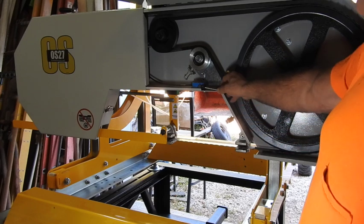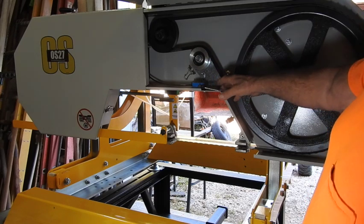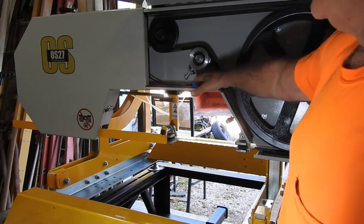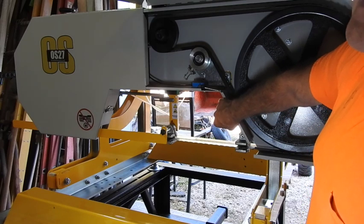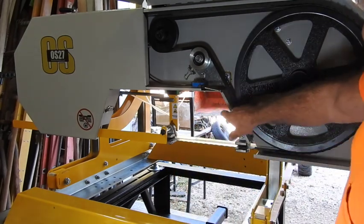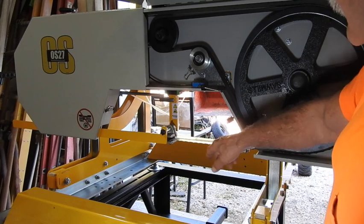This one here also, I think some of the earlier ones didn't have the micro switches that shut the system down in the event you open up the door. And this one here actually has a safety switch on this door and on that door over there, as well as they've got a safety catch on the latch. It's got a little fella in there that you've either got to depress or push up or pull down in order to get the little clips to open up.